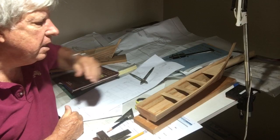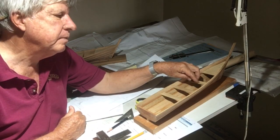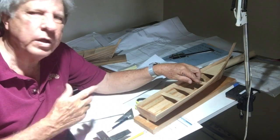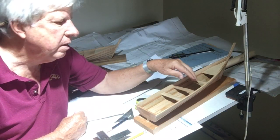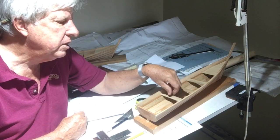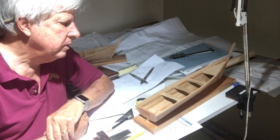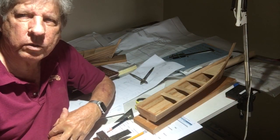The key is to locate the first seat — there is only one set of oars used in this particular boat. Once we locate the seat, we'll know where the thole pin goes, and from there we can determine where all the other seats are located. I've also made the front deck cover, so we can now start installing the ribs.